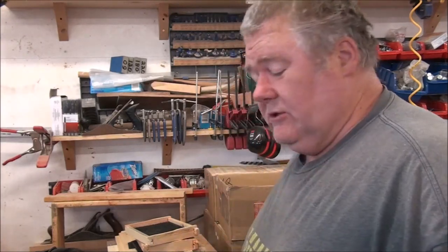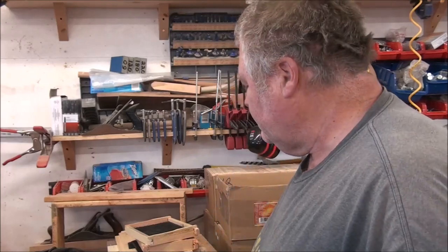There are quite a few I culled, because anywhere you run through a knot on that piece of lumber, the lumber's really nice, but it's always going to have some knots. So you just don't want to put too many knots in that little top bar. It won't hold up structurally.